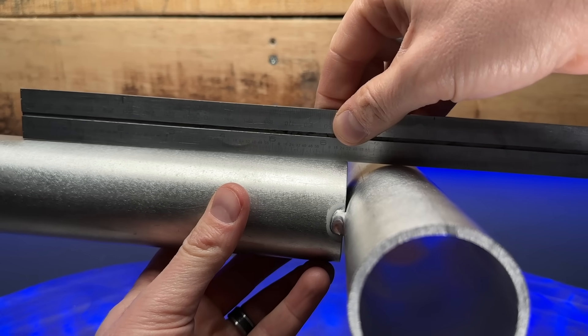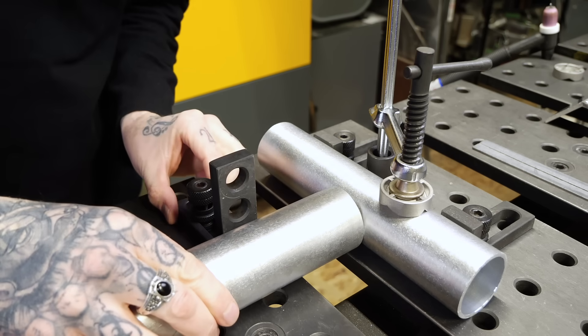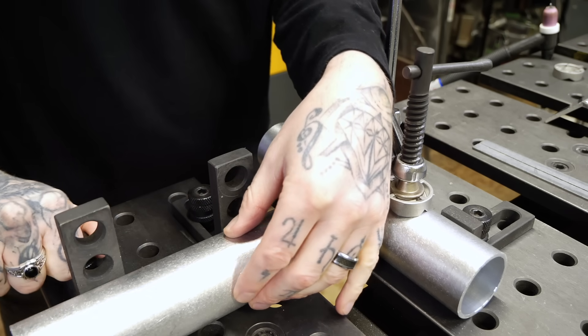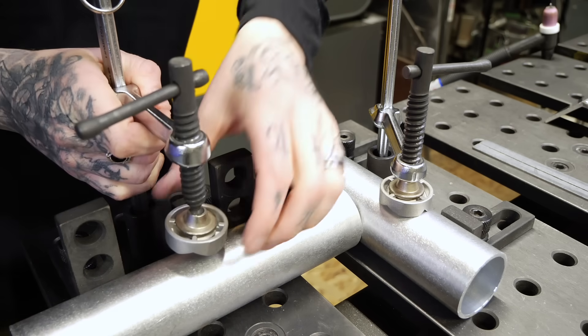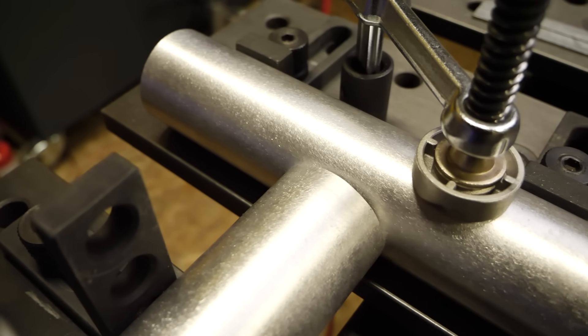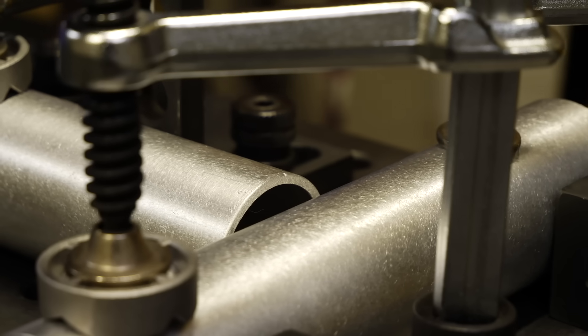We want everything to line up nice and straight. One of the most important parts to dealing with this gap is to properly secure and align the joint. I'm going to assemble a small jig fixture on my Strong Hand Tools table here, using little fences and bolts to lock everything in place and keep it 90 degrees and square. I'll also securely clamp the pieces so they don't move when I'm tacking. If you don't have a fancy table, you can use angle material or scrap as long as it's straight and properly clamped so nothing moves while you're welding.